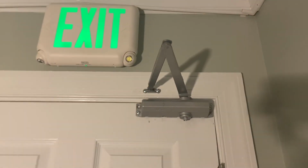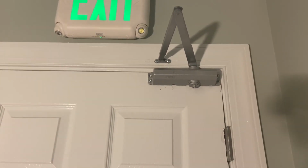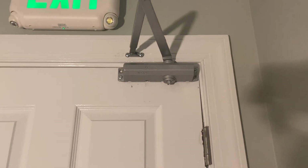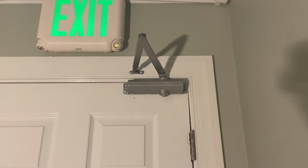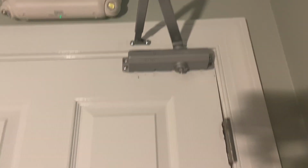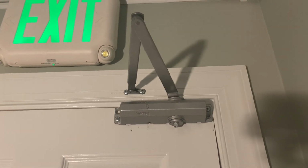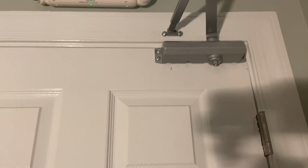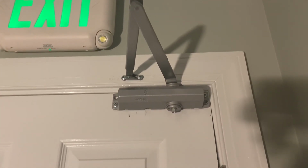My one and only knock with this closer, actually two things. One, unless it's just the unit I got, which could be a plus or minus, the door almost seems too light. Compared to my other two residential closers, those actually require a little bit more force, but this one felt too light, and I had to make some adjustments with the door because the thing would refuse to latch even with the valve almost backed all the way out, which could be why the previous installer backed it all the way out, but I was careful not to. Unless that was just a defective unit, I don't know, but it still works fine right now.